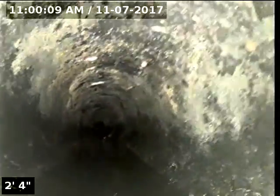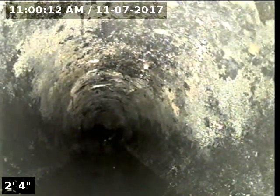So the purpose of this sewer line inspection is to determine the condition and serviceability of the sewer lateral on this property to the city main. I'll zero out when I hear it, once I feel like there's a lateral drop out to the outside. I have water running from the kitchen sink. Once we see that, I'll zero out my foot counter once I see the water.